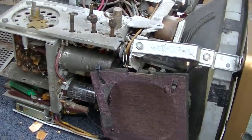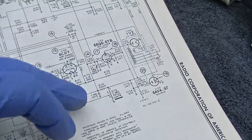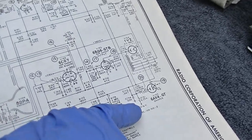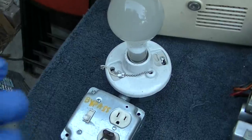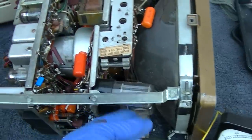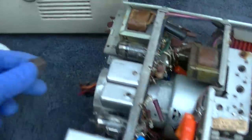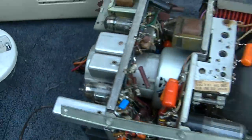We don't know what it is — it could just be that the oscillator is not running, the flyback's bad, a problem with capacitors, the yoke is shorted, the damper's bad, or the horizontal output is shorting. Something sucked too much power through this fuse into the high voltage circuit. I think that's a 200-watt bulb. I've got my milliamp meter — going to hook it across the fuse. I'll just see what happens. I'm not too worried about this; I don't really care enough to bring it up slow.